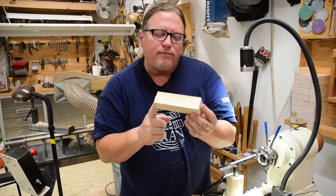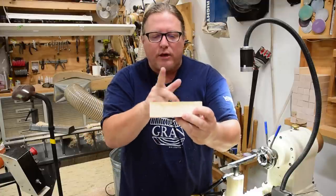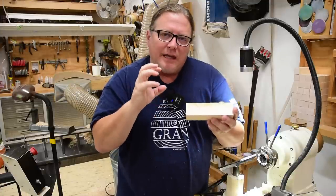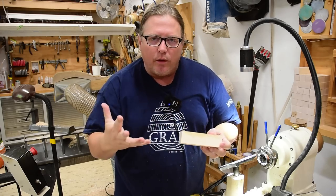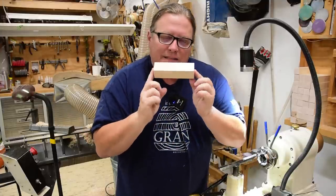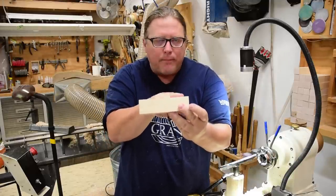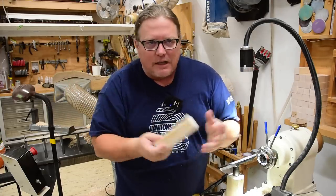This is a standard size I use — about five and a half inches long — because in my normal top production I can get three tops out of it. If I make it a little bit longer to get four, I get more vibration on the end and don't get as clean a cut, so three is my max. My downside right now is I'm only getting two tippy tops and one small regular top — not three tippy tops with the way I do this.